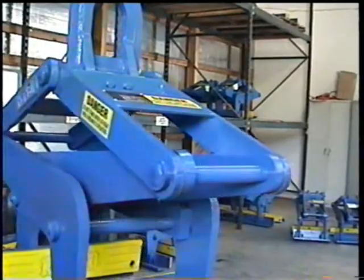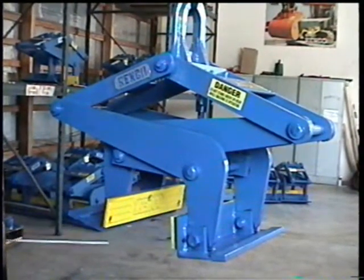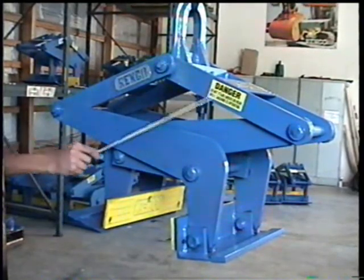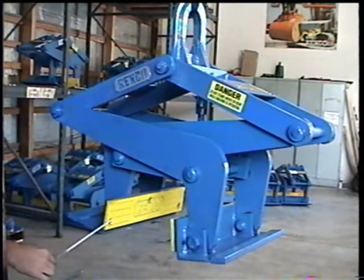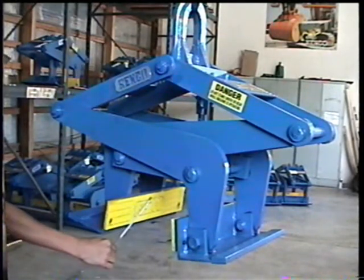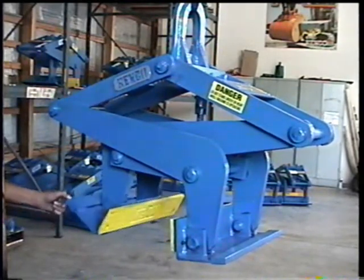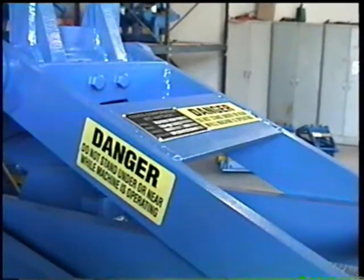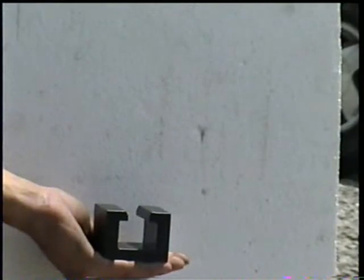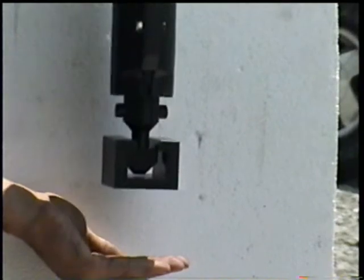We will now cover the important aspects of maintenance on your barrier lifter and performing inspections. Visually inspect the lifter every day for signs of stress or wear. Check to make sure the pad bolts and nuts are snug. Make sure the pad angles pivot freely and there is no debris that may jam the pad angles or lower legs. Check to make sure the warning labels are present and readable. For automatic units, check the actuator bolts for looseness. Check the latching end of the actuator for wear and alignment with its receiver block.